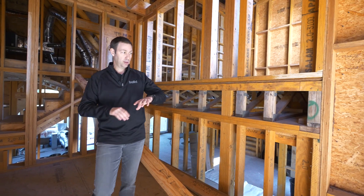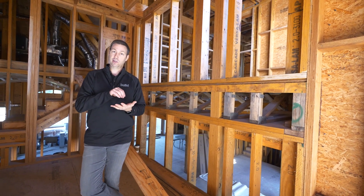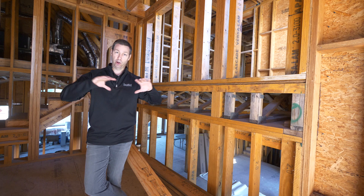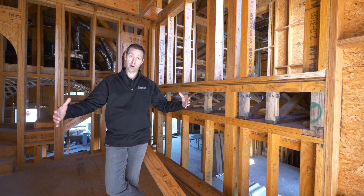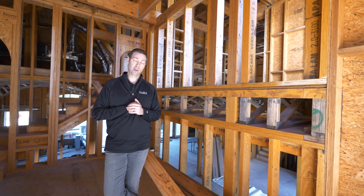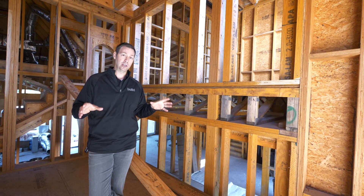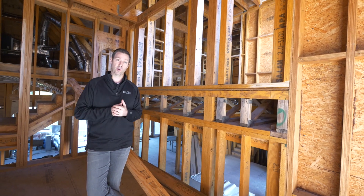The last thing I want to mention is that because this house is built entirely from engineered materials — engineered sheathing, engineered studs — there's very little ability for water to soak in, which means we need to take a lot of precautions on the outside to keep this house dry. I've got overhangs over most of the house, so there's a good umbrella over it. But the raincoat is really important when using all man-made studs like this. We've got Delta Vent SA from Dorken on the outside — very watertight, super airtight — and we've also got an air gap behind our cladding. If you're building in a hurricane-prone area or just want a house that can withstand extreme weather, this is one way to do it.